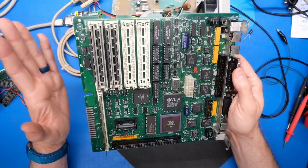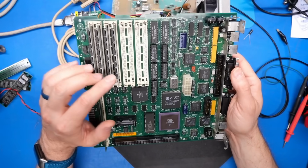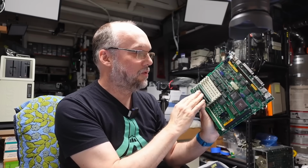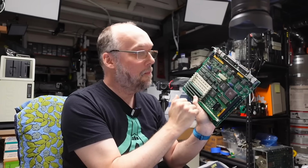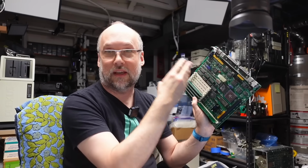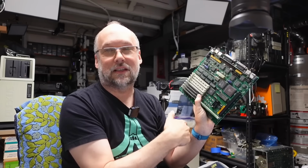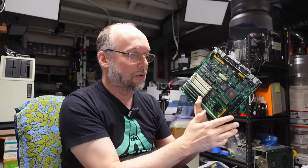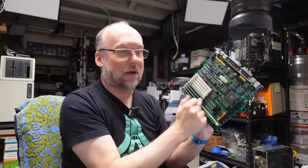So if you think about what might be going on, maybe there's a broken connection between these lower three SIMs and the CPU, so it's not able to read and write to those data lines. Now, if we had a motherboard with a bus transceiver between the RAM and the CPU, say 245 bus transceivers, maybe 3 of those were bad, or maybe the logic that controls those chips was bad, maybe damaged by some leakage from a capacitor. But I talked about this in the last video. The Macintosh SE/30 does not use bus transceivers anywhere on the motherboard. They are supposed to be used on cards plugged into this expansion slot, but anything on the motherboard itself is just directly connected to each other.